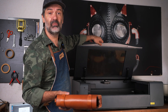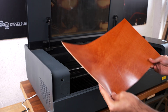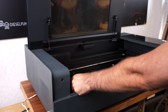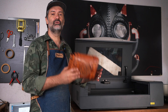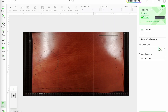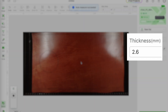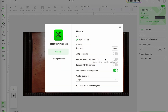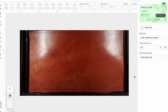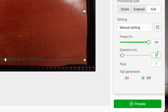The work area is pretty big, so plenty of room even for the large pieces like this one. Before we do anything else, we need to measure the material thickness and the P2 will do that automatically with a click of a button. Next, go to settings and make sure precise vector path and DXF file parsing are checked, and then select the lines you want to cut and set the power and the speed.